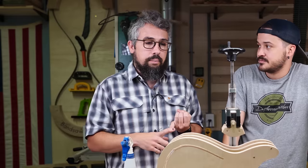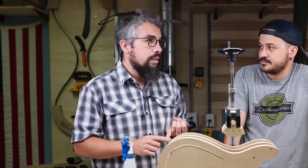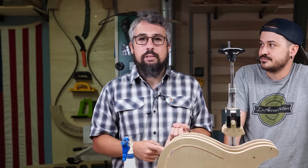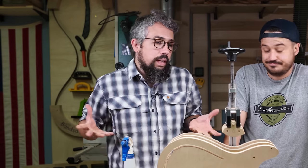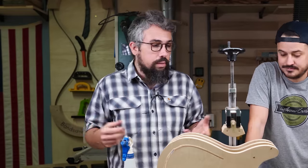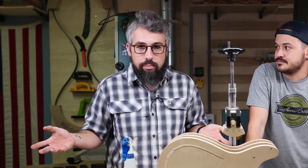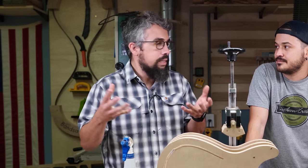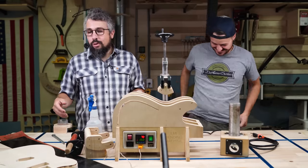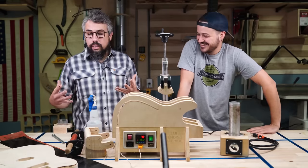Issues with plastic binding, in my opinion, are that it always eventually delaminates because plastic and wood just don't get along very well. The main reason is they shrink and expand at different rates. Over time, 50 years from now, your plastic is gonna get brittle and it's gonna look like every old Martin and Gibson you've ever seen where the plastic starts to go. Not that there's anything wrong with that — it's just old plastic.